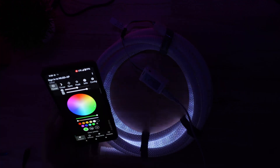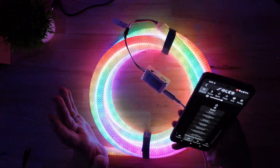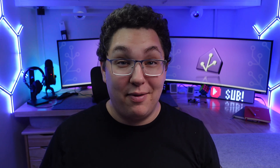This device also has a microphone and it's running the sound-reactive version of WLED, which means you can't update it directly via Home Assistant or it's going to wipe out that sound-reactive version. I really like that this one is so small yet has so many features and can be powered by USB-C. It also says it supports ESPHome, but this doesn't mean it runs ESPHome alongside WLED — you could flash ESPHome instead of WLED, but that defeats the purpose of buying a WLED controller in the first place.